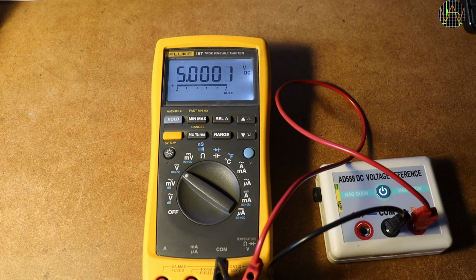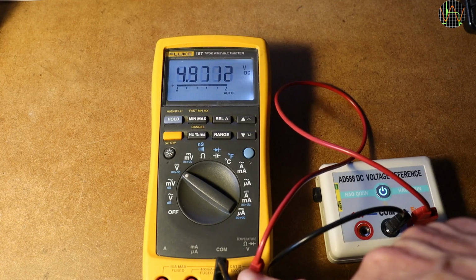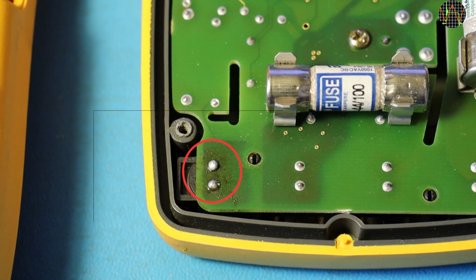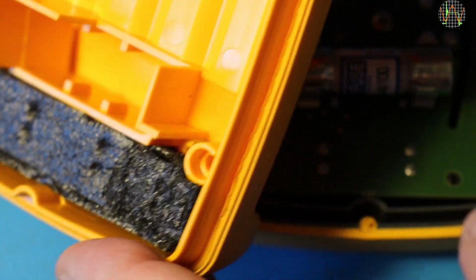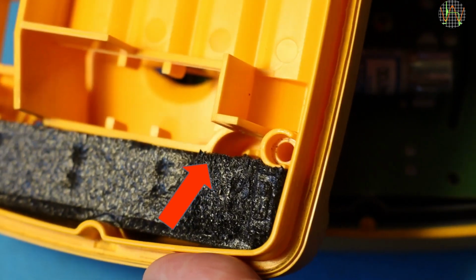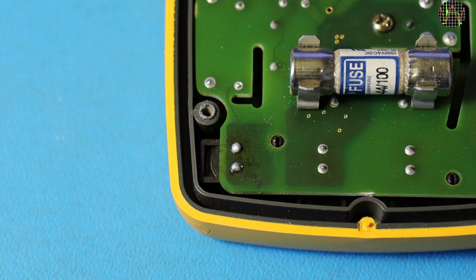There is a workaround as a temporary fix while waiting for parts. With that, it's kind of usable most of the time, but it's very fragile and one has to be extremely careful inserting or extracting plugs into the rightmost socket. A cold or broken solder joint, I hear you say. That's what I thought too, but no, resoldering did not help. The workaround is to stuff extra foam into the rear housing above that socket. When assembled, that extra foam presses the PCB against the socket, and when the moon is right and the stars align, it makes contact. Sort of.